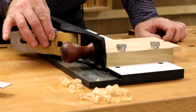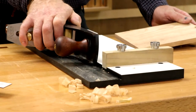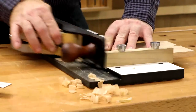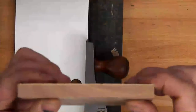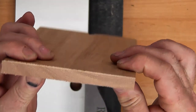The most important thing with this is you keep the plane square on that corner. You don't go tilting here. All right. Two, Ben, please. All right. Don't go lifting the plane up and getting impatient. This is about almost fingertip control and going through. Just work it. Okay. You also will get, I think if we can see it on there, a cleaner finish than you will get off your table saw or anything else. It's slicing, it's cutting.